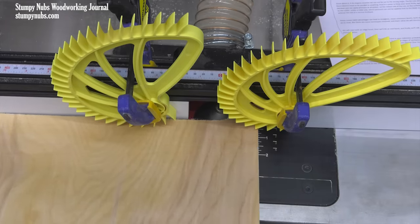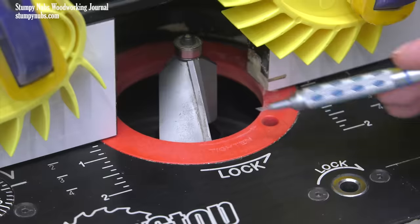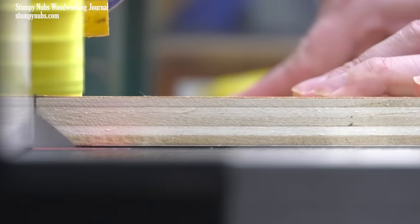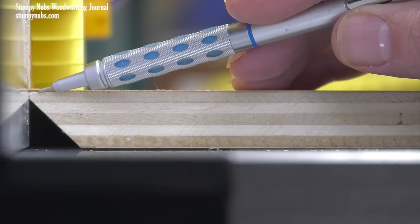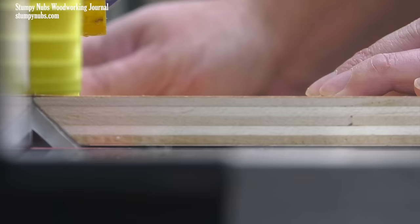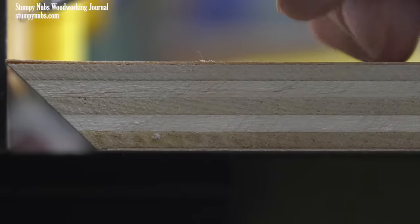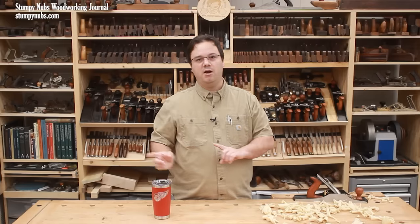This shift can leave a mark on your beveled edge, and you will get some nasty snipe as the bit exits the cut on the end of the workpiece. The first solution is to set the bit height so the bottom corner is just above the surface of the table, then set the fence so the bit will cut almost, but not entirely, to the top of the workpiece. This will leave a flat portion at the top of the bevel which can ride against your fence and support the cut. For a crisper, more knife-like edge, move the fence back a tiny bit more and make another cut. The goal is to incrementally reduce that flat edge to a hair's width without removing it entirely. It may take a couple test cuts, but once you get your fence dialed in, you can lock it down and cut all your workpieces.